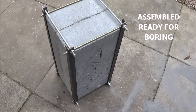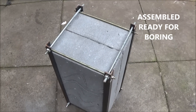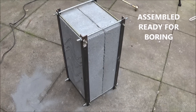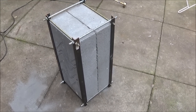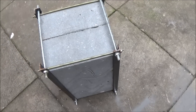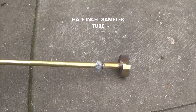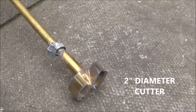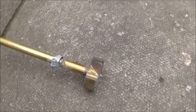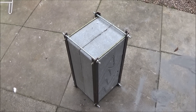So this is my block forge made out of two thermolite blocks, held together with angle iron and eight millimeter threaded studding. I'm going to be drilling down through the top using my Bosch drill with a piece of tube that has been split at the end, and the two inch woodwork cutter has been pushed up in the tube and held in place with a jubilee clip. I'm going to drill down through the top and in from the side or front face to meet the down hole.